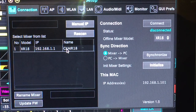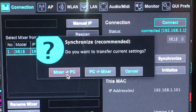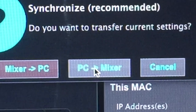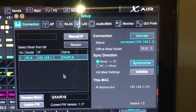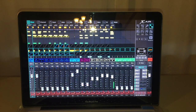Within the setup menu, all I have to do is find my mixer — it's right there, and I know the name. I'll click on it, it highlights, then I'll hit the connect button. I have two choices: mixer to PC, or PC to mixer. Mixer to PC means whatever configurations are inside the mixer, the computer will adjust to those settings. PC to mixer means the mixer adjusts to whatever's on the computer. I'll click mixer to PC, and once that boots up we should see a signal on channels 17 and 18 — and there's our signal. I can close the setup menu and we are hooked up to the Behringer XR18 via built-in Wi-Fi.